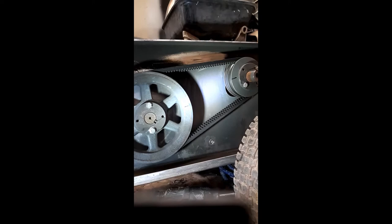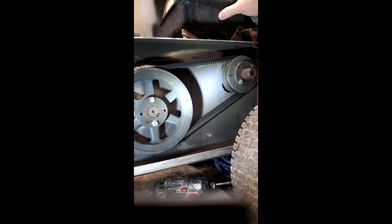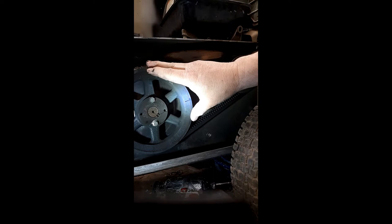When the engine is running at 3,500 RPM on a direct drive, that means the pump is also running at 3,500 RPM — giving you 4,000 PSI and three and a half gallons per minute. Now to illustrate the difference with a belt drive, I've got two marks lined up here: one on the engine pulley and one on the pump pulley, straight across from each other.